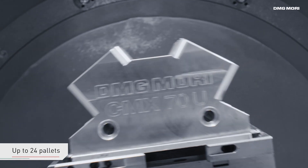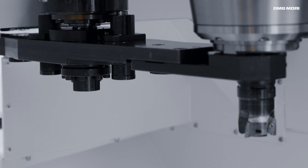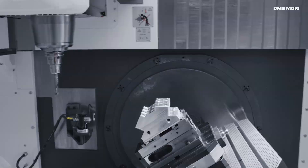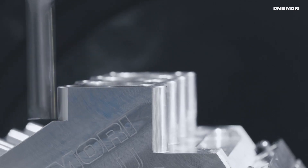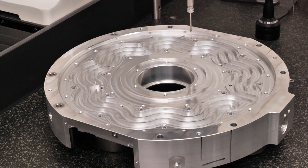This is a three-plus-two, not a full five-axis — so what are the main differences? The reason this machine was developed was because we were producing full five-axis simultaneous machines and we realised quite a lot of our customers didn't actually need that level — they weren't using full five-axis. That's why we developed this machine, which allows us to reduce the price and complexity while still producing really complex parts.